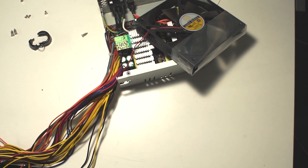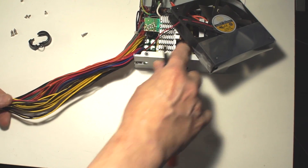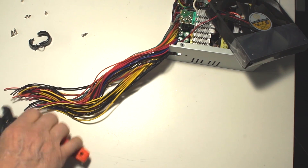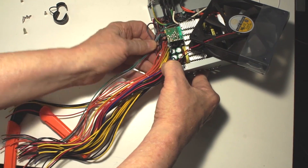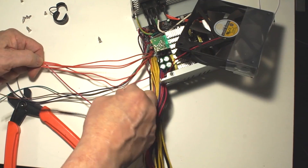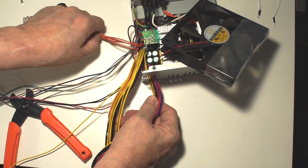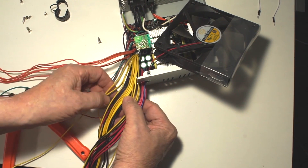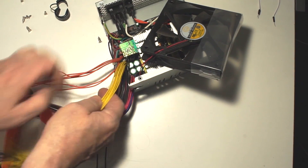So let's cut these things out of the way and get them to a manageable length. I'll lift that power supply out — it looks like there are at least four screws that hold it in place, maybe one in the middle. The fan does not unplug, so I may end up cutting it out of the way. In cutting these right now, I'm making them about a foot long, so in the end they're probably going to be just a few inches long. The orange are the 3.3 volts, which I don't need. The yellow is 12 volts, and the red is the one I'm really going for — the 5 volt. Black is ground, and the circuit board may also be grounded, so the black wires may be redundant, but for noise I'm going to ground them.